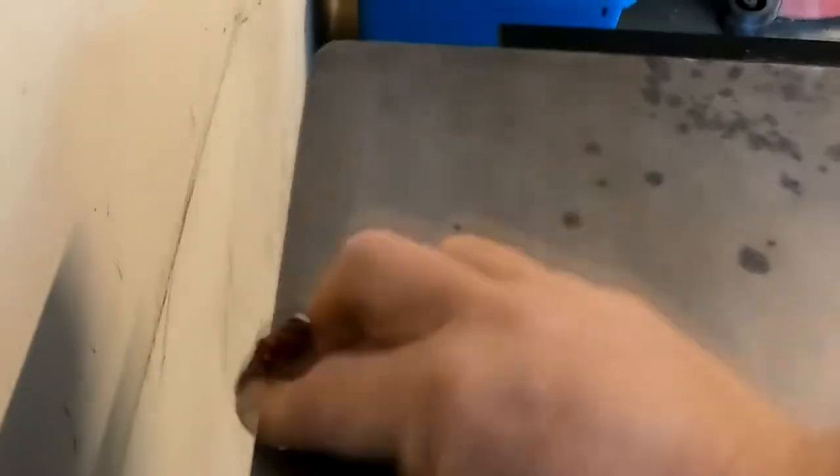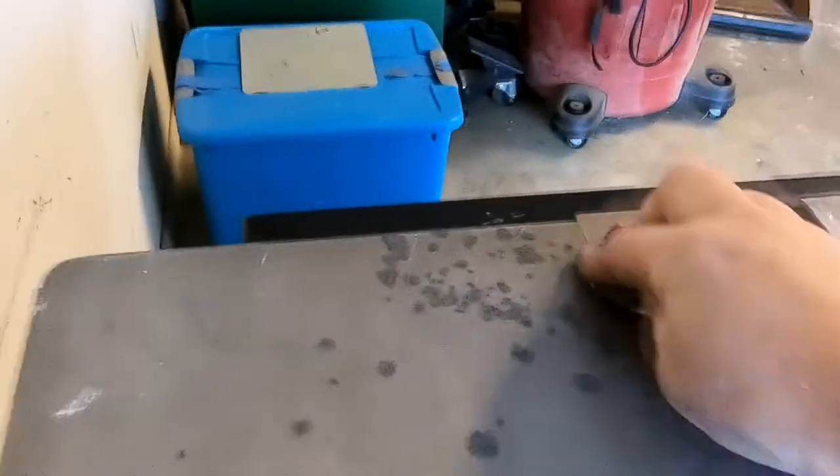Next up is to clean the table really good with a rubbing compound. Rubbing compounds are a really mild abrasive — it'll clean up a lot of this small surface dirt, any leftover mild flash rust sitting on there. You rub it in pretty good, just work it in, let it dry, and then rub it off. Sometimes if you've got a really dirty surface it can stick to the table and be hard to polish off — you might have to do several applications — but basically just clean it. You can work in a circular motion on this one, but always good to go with the grain.